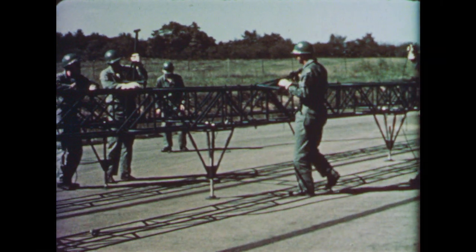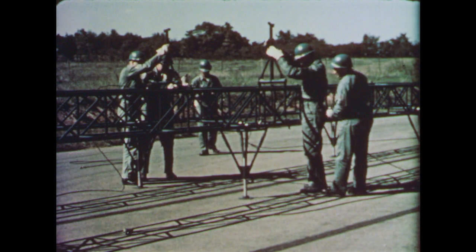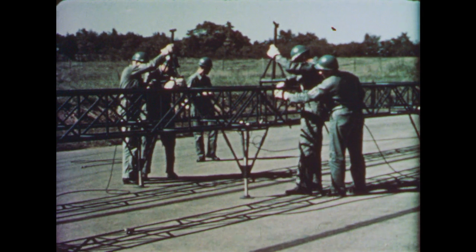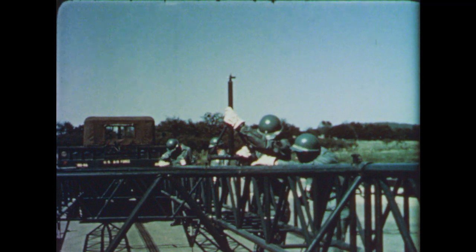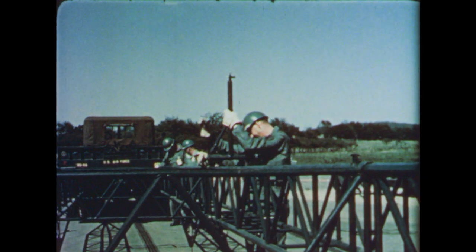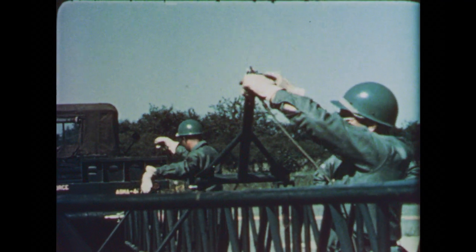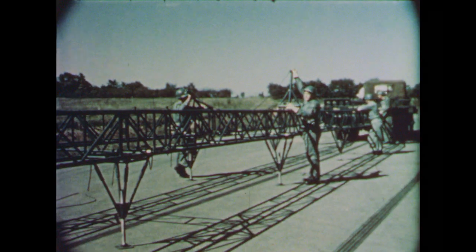Two cable supports for the tension cables are placed on the H-frame near the center spreader. A shackle on each side of a top plate is furnished for cable attachment. These supports are free to pivot and are held in place by self-locking pins. Shackles are removed from the support plate and the cable is inserted in each one.